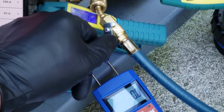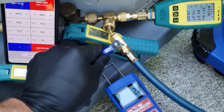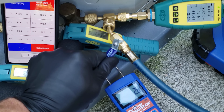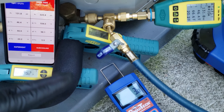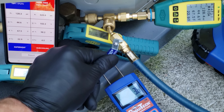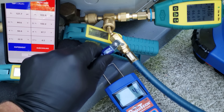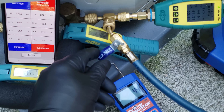So I'm going to add a little bit of refrigerant. We want to add a little bit at a time — we don't want to add too much because we don't want to slug the compressor. We're going to add this a little bit slower. We're at 2.2 ounces added in. You have a vapor compressor that should only have vapor entering it, and the suction line goes right into the compressor, so you don't want to just completely open up this valve and have liquid refrigerant entering.